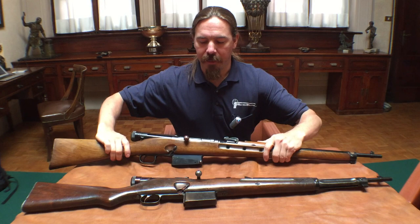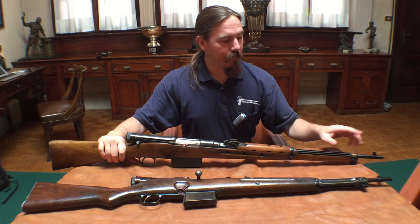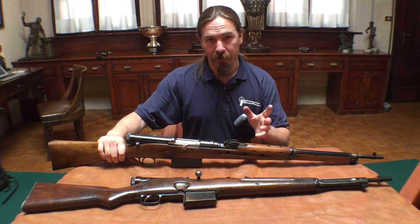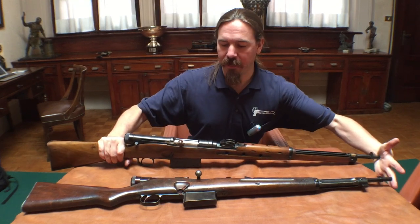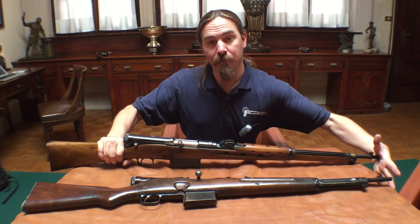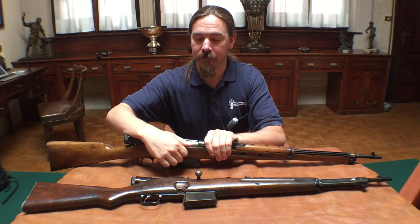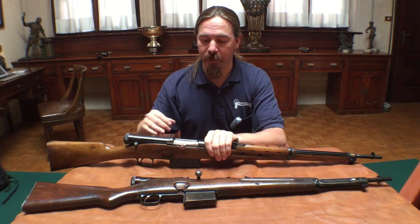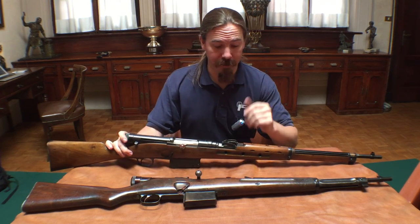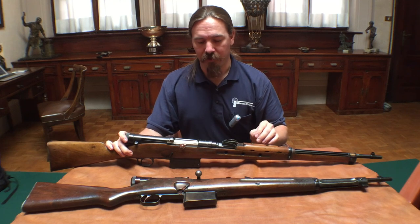What Marengoni came up with was a short recoil action semi-automatic rifle. We have a rotating bolt with six locking lugs on the front. When I say short recoil, what I mean is that when you fire, the barrel and the locking section cycle back about a quarter inch — 8 to 10mm — like that. When it's all the way to the rear, the bolt is cammed up slightly — that's unlocked — and once unlocked it can cycle backwards to extract and eject the empty case and load a new one. This is actually kind of like the 1941 Johnson rifle, although this predated the Johnson substantially.